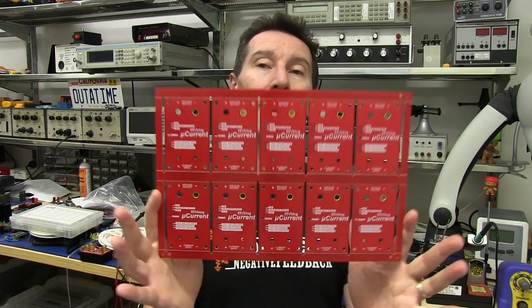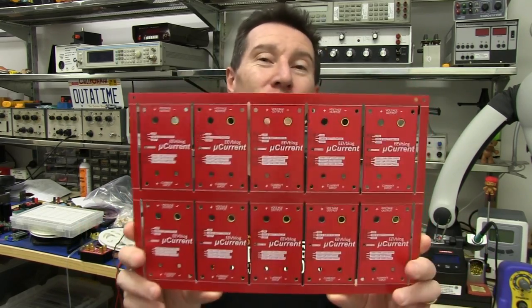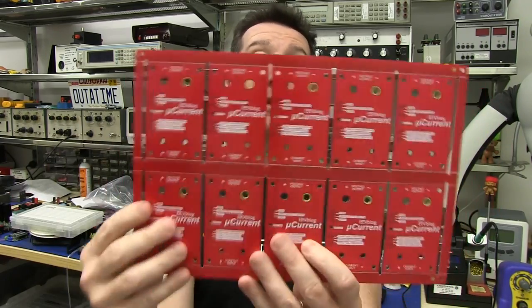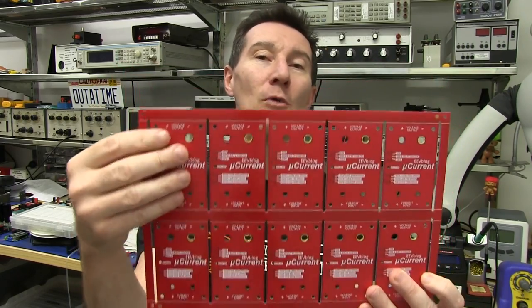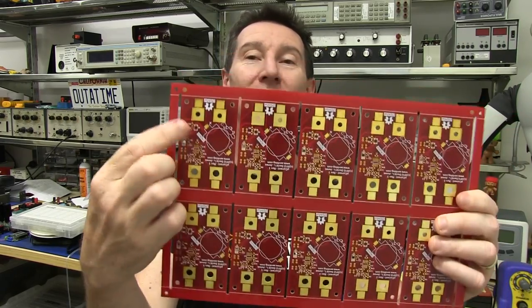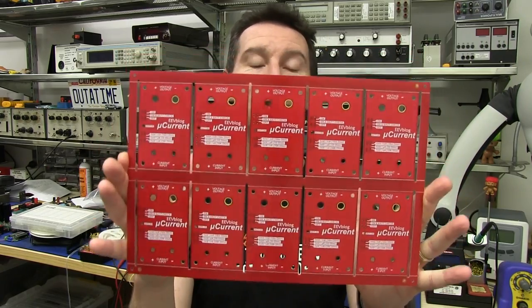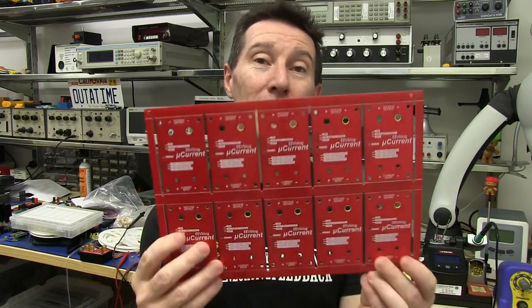What people will do with their panels if they're a beginner, being lazy, not doing a huge run, or don't want to invest in an automated test system — typically they'll put it in a panel like this. This is pretty essential when getting boards manufactured, especially for small boards. When it goes through the pick and place machine, instead of manufacturing one tiny board at a time, you can pick and place all the parts at once. There are real big advantages to doing that, and most people do that for any reasonable quantity.